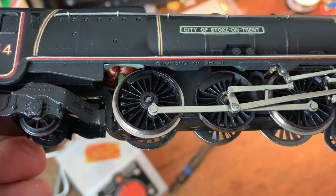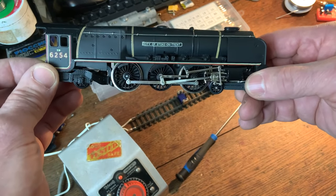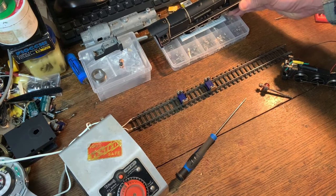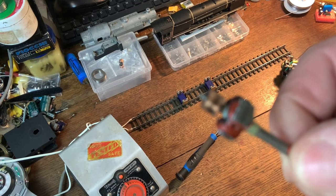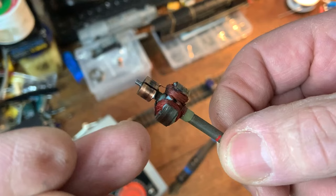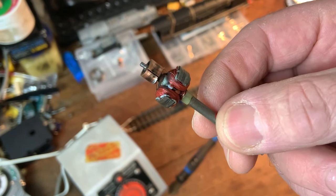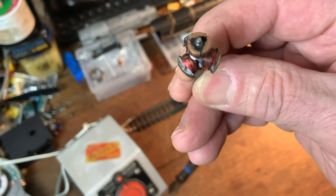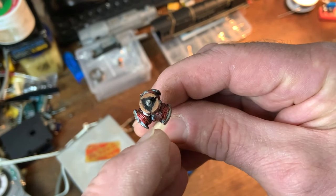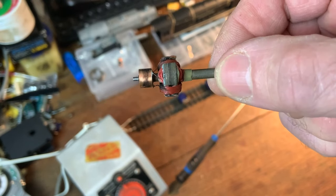We'll go up to the main Super Four layout later in this video and compare this with a standard Stoke-on-Trent or another City. We've got the five-pole armature in there and these slightly larger wheels fitted, and the whole loco is looking rather splendid. For timing - because you do have to time electric motors - if I hold it in this direction you can see that the slots in the commutator line up exactly halfway between the pole pieces. That's all I've got to do when I put the new one on, and then carefully resolder the wires.